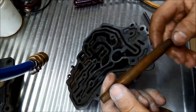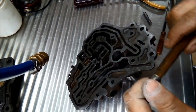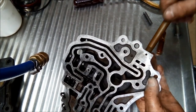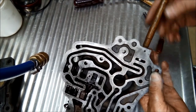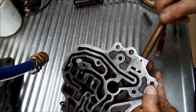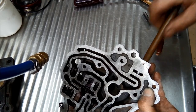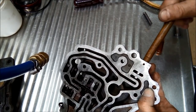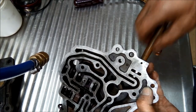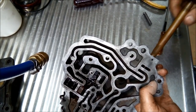Using a little piece of dowel that fits nicely in the bore. There's a fair bit of resistance so I'll work it just dry like that, then wash it out with clean solvent and blow it out again. Washing the whole thing out as it probably still has fine metal in there. That's already feeling a lot better.